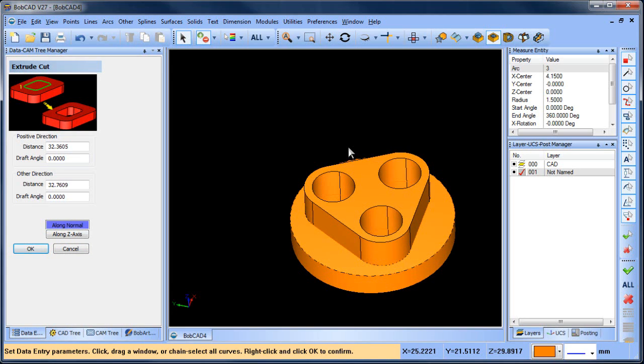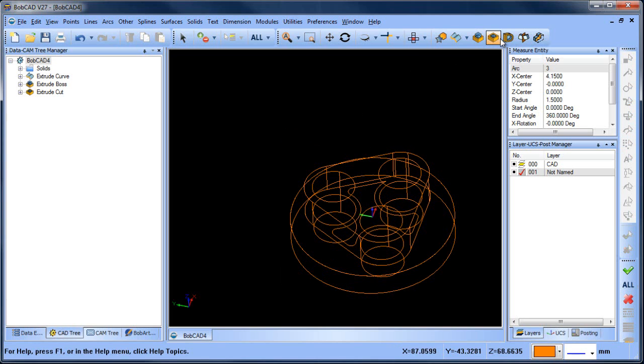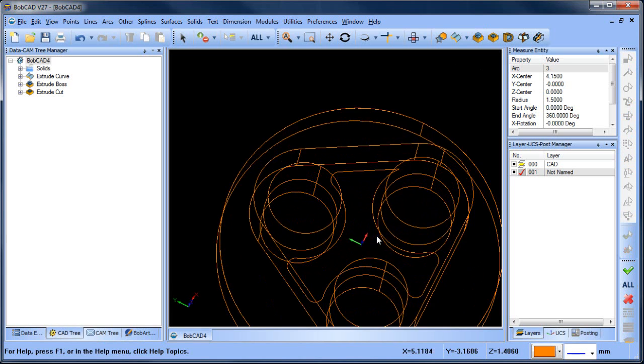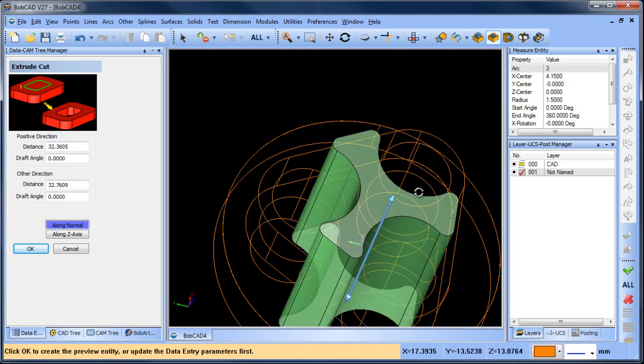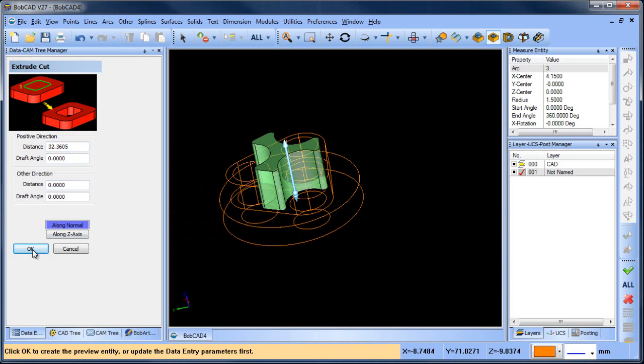This one here — so this is 35 and 15 — I think these just go straight through. We'll do extrude cut and select... looks like I forgot to put a radius in that corner. Arc fillet, so we'll get a radius in there, do extrude cut — we're gonna say zero on this end here, and we want that to break through. So that looks good.